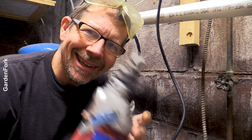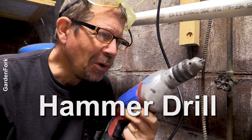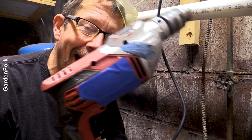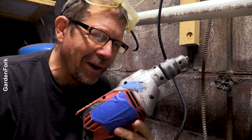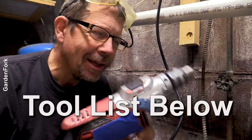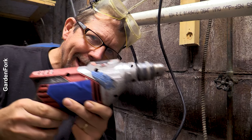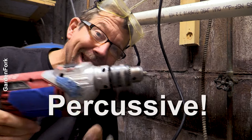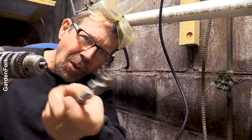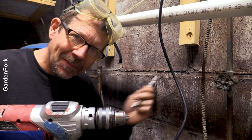What you're missing is this and some knowledge. This is a hammer drill. Don't be daunted by that name. This is an amazing tool that I think you should consider adding to your toolbox. I've had this one forever, used it a lot, and it was inexpensive. In addition to turning, it is percussive — it hammers. It takes this drill bit and hammers while turning it at the same time into the cement. That is key.